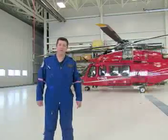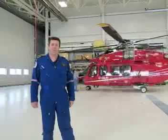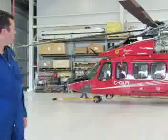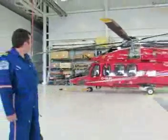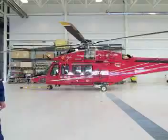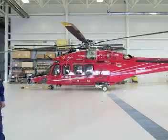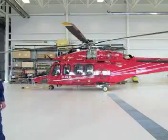Good morning, everyone. I'm going to be giving a briefing this morning on the preliminary safety aspects of the AW139. General description of the aircraft: very high main rotor system, high main tail rotor system. In general, clearance for people should be fine with the main rotor. However, in terrain that is rough, rising terrain on left and right, you still have to be cautious of the main rotor and the tail rotor, as they could become quite low to the ground.